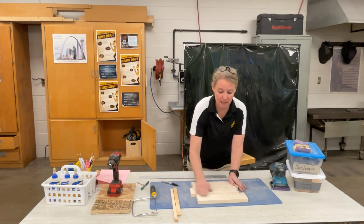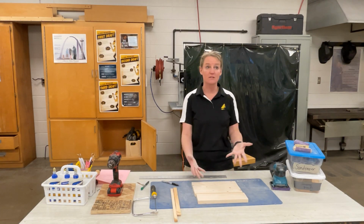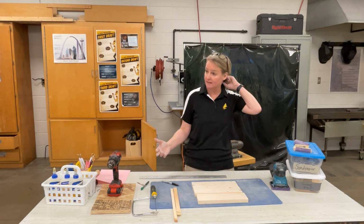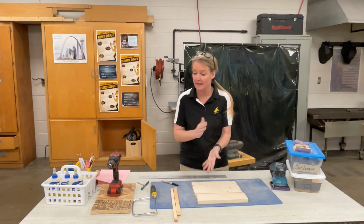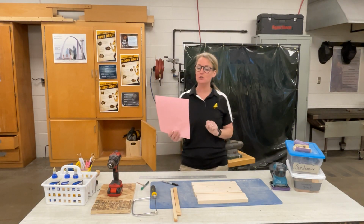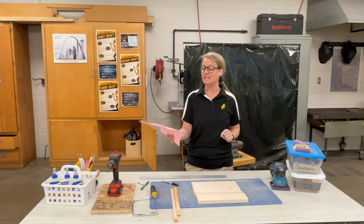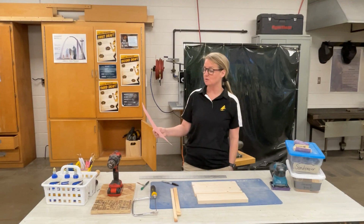All right, so now that I have everything sanded, feel free to come up and ask the teacher if it's good enough. I'll give you my honest opinion. If it is, great. If it's not, I'm going to say do a little bit more. That is your choice, your grade. All right, step number 4, it says get 2 strips of wood and place on the back side of your boards. Mark where you are going to drill your nail holes with a pencil.